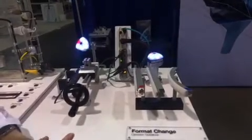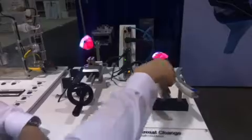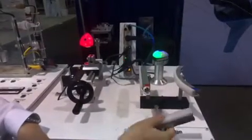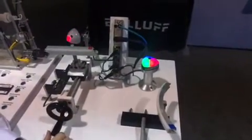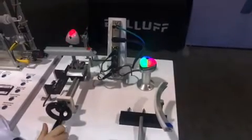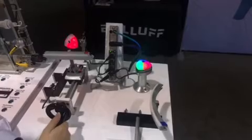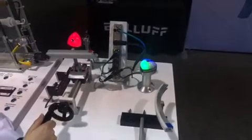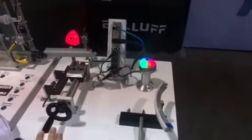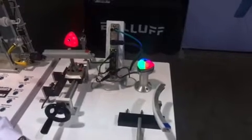Right now it's in a little bit of a demo mode, so even though it looks like it's asking for the red adjustment part, it might not be — I'm just going to choose the green one. It looks like it was actually asking for the red adjustment part, so we're going to put the green one down and select the correct part. Once I insert it, it's telling me I need to turn my crank this direction. I've gone a little too far, so now I need to go back the other way. Once I get that light completely solid — almost there — it will mean I've got it right in the right spot. That looks pretty good. Now we can run our process without the fear of having scrap or spending extra time adjusting.